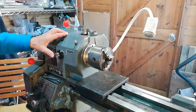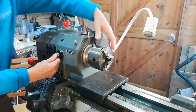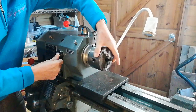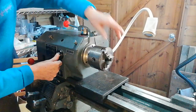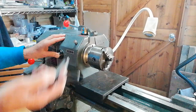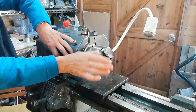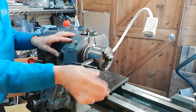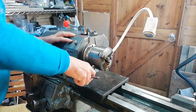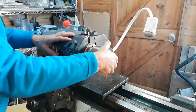On this particular machine there's what they call a spindle lock button. So you press it and turn the spindle — you'll hear it and feel it lock in, and that's what you want. Then take the chuck key, slide it into position into one of the chuck jaws, and just firmly give it a tap and it moved — so that released it.